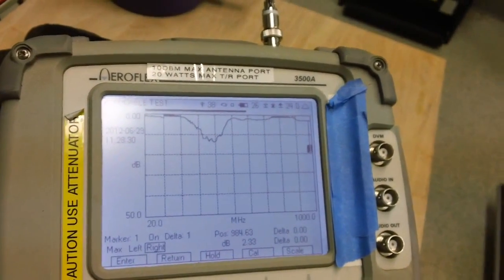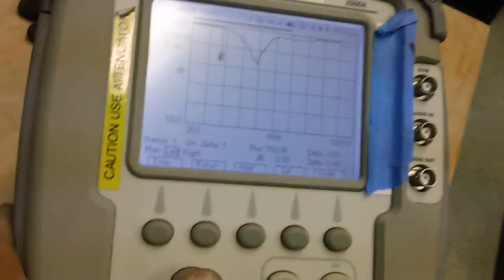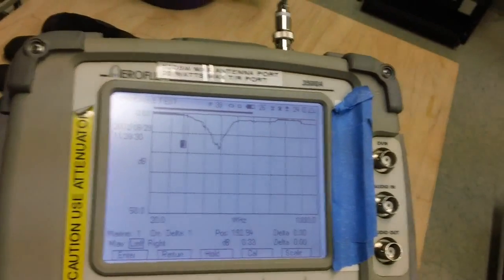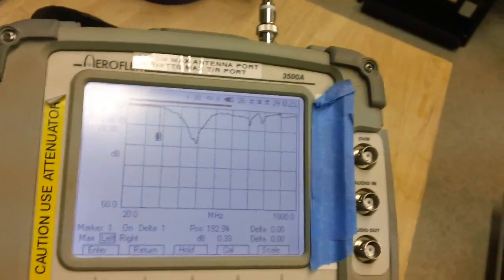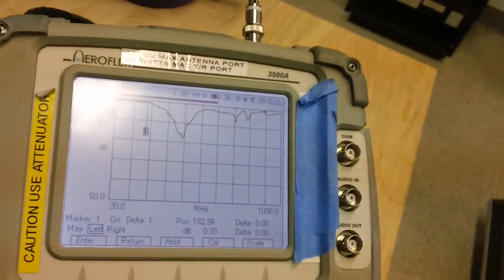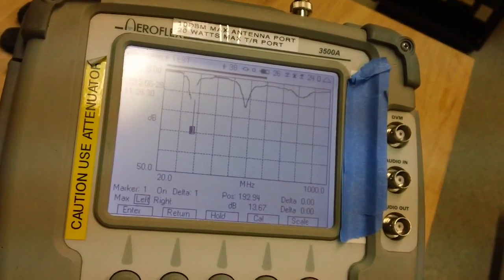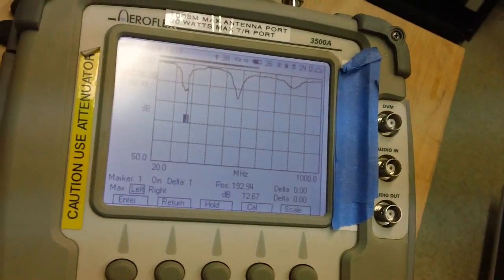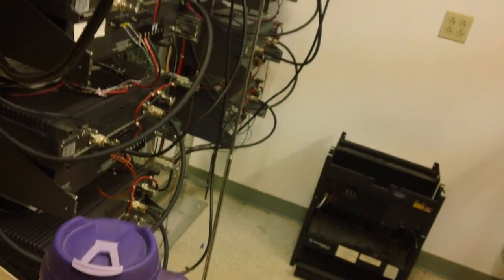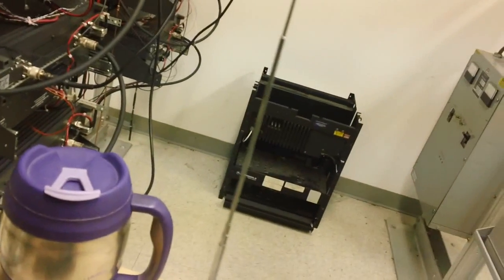Look how it changes the whole waveform of that antenna. At UHF range, if I go longer - around 16 inches - it's going to shift right into the 150MHz range. And it did, right on the spot. You also have a harmonic in the 500-600 megahertz range.